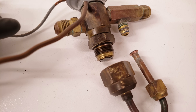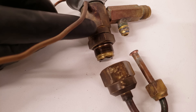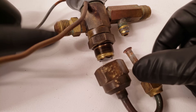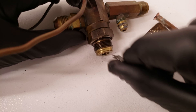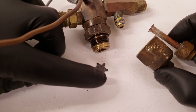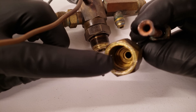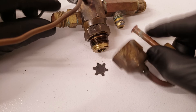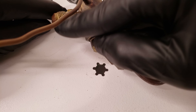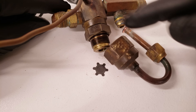In the bypass feature, refrigerant comes this way from the indoor coil, which is now the condenser coil, pushes that plate down, and goes around the perimeter of this plate — it has five or six pathways to go around it. That happens down in the bottom of this, and then the refrigerant continues to travel as a high-pressure liquid, coming through this way and exiting out.